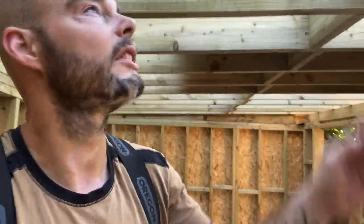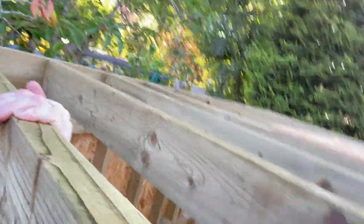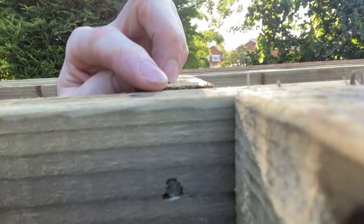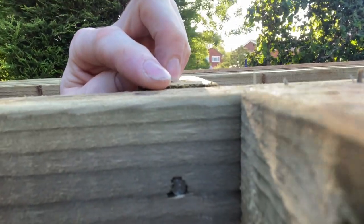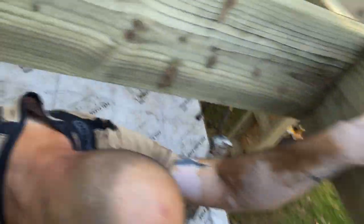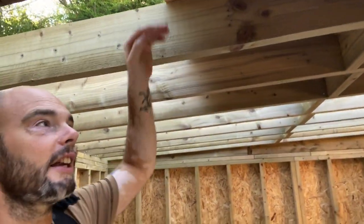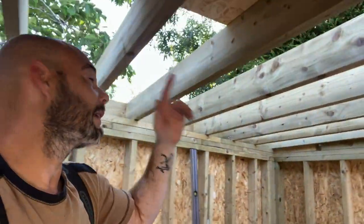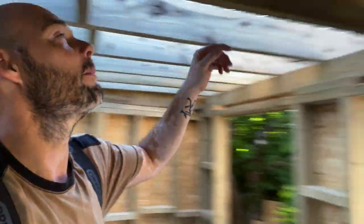The other thing I'm doing this morning - let me find a good example. You can just see on these parts here it's raised up, and this isn't the worst one - there are some absolutely terrible ones. So what I'm going to do is chamfer that edge off with my electric plane, just quickly run it down, zip them off, level them off, so that when my boards sit on them they're going to fit flush and not kink up in certain places.